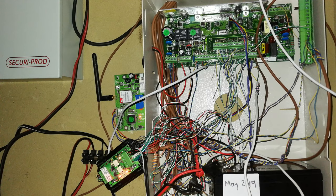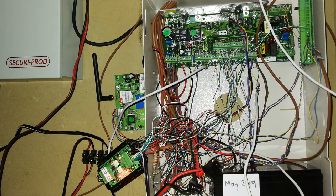In this video I'm going to explain how alarm systems get drained - what I mean by drain is when they get overloaded and the battery does not last very long. For example, a 7 amp hour battery is common for most homes and it's sufficient, but as your alarm system grows - you add more zones, keypads, maybe a mag lock, or beams - you find that the backup time when the power goes out is getting too short.